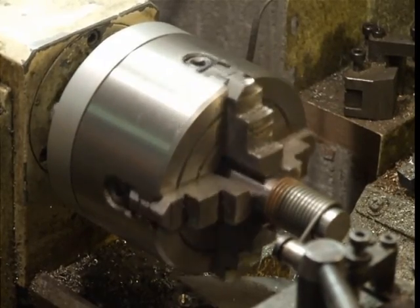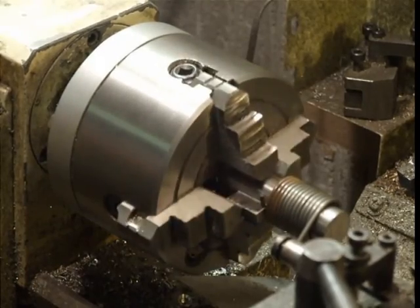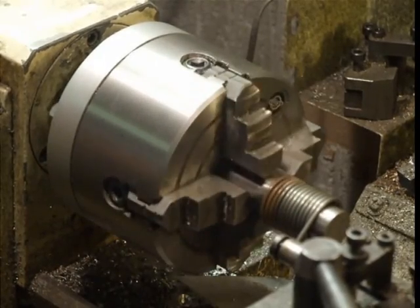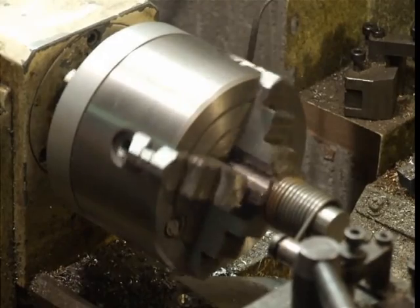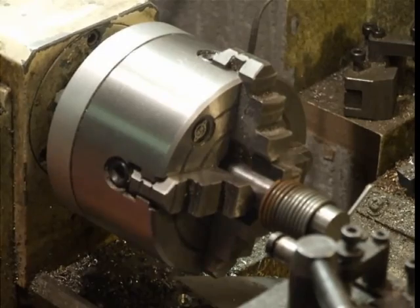At the end of the first turn, a small adjustment of the guide position with the compound ensures the turn clears the free end of the spring. After 11 turns, the spring winding tension is released and the spring expands to its finished diameter. The spring was designed to give a minimum of 7 pound inch of torque at 240 degrees of deflection.